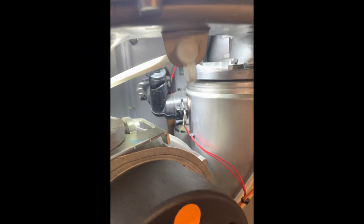Let's start taking it apart. Disconnect the fan, then use a 13mm spanner to take the heat exchanger apart. Move it slightly out of the way — that keeps it clamped down — enabling it to come out a little bit more easily. Remove that out of the way and pop that bit off.